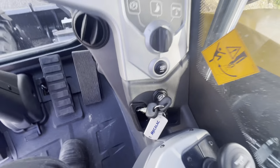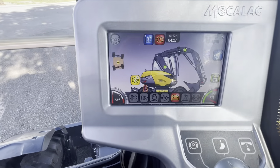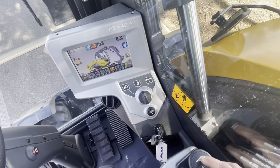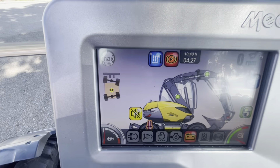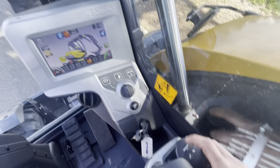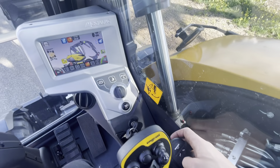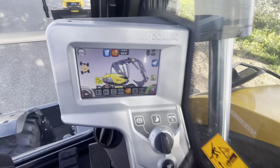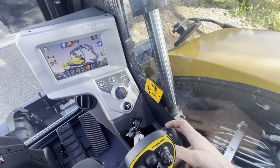So moving down, we've got the blade and stabilizers. So if you look at this screen, you've got these buttons. You press the blade and you see the blade come up here — that's turning the blade on. So whatever's turned on, you've got the stabilizers. So let's turn them all on — if all three are on, when you move the blade lever, all three will move up and down. Turn the blade off, only the rear stabilizers. Turn the left one off, only the right will come up and down. So you can choose what you want on and off by just pressing the buttons and then moving the blade lever. Quite simple.